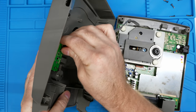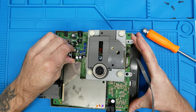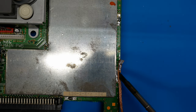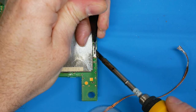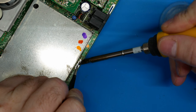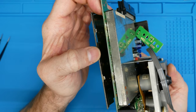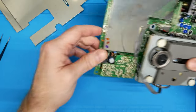Watch this ribbon cable — it's just held in with these two plastic prongs. You will have shields top and bottom. You have to take the bottom one off just to access the top one. I find that saturating that braid in no-clean flux helps to wick that solder away. It really helps if you use an object to push on those prongs while you're heating it up. Once you get all the solder off, just keep jiggling it and moving it around so it doesn't re-solidify. Now this thing's finally free — it's some work just to get those shields off.